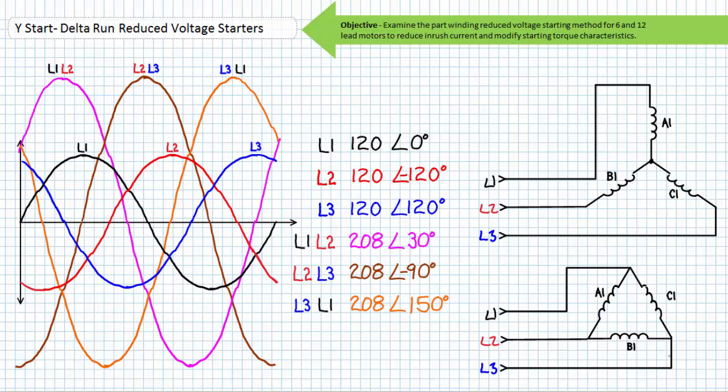Consider a light industrial three-phase AC system characterized by a 120 volt line-to-neutral and 208 volt line-to-line value. If this motor was placed in a Y configuration, each winding would experience the comparatively smaller line-to-neutral value of 120 volts RMS. If however this motor was placed in a delta configuration, each winding would experience the comparatively larger line-to-line value of 208 volts RMS. Herein lies the mathematical trickery: although the system voltage remains constant, the different configurations see different aspects of the same system voltage — Y sees the smaller line-to-neutral voltage, and delta sees the larger line-to-line voltage.